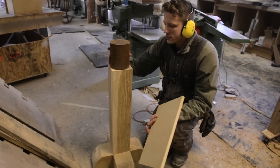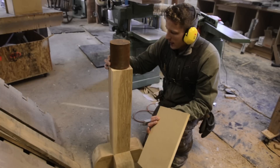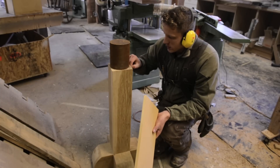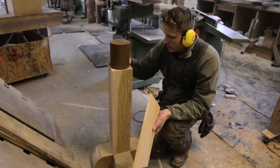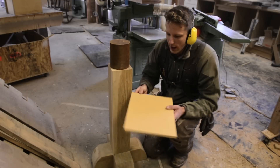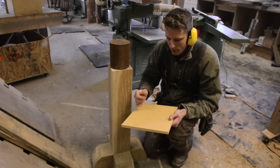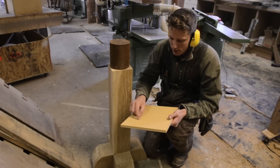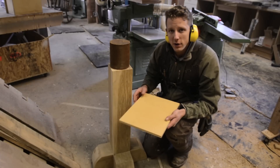This is my anvil, which is just a solid chunk of five-inch diameter steel. I'm going to router it down an inch and a half into the stand so it's not going anywhere. To do that I'm going to use a piece of MDF, cut a circle in it, put a bushing on my router, screw that on top, and just router out a perfect circle for this thing.